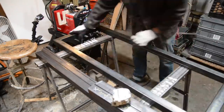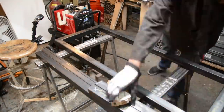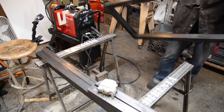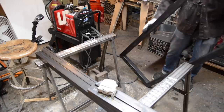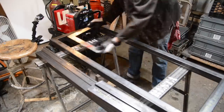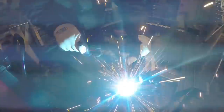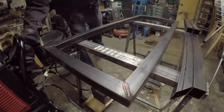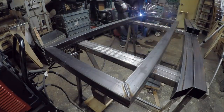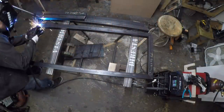This is what's going to be the seat — that's the spot where I began. I check my diagonals and I'm off by about three quarters of an inch, but because I'm just tacked I can still rack the frame a little bit by tapping it on the ground. Just those few little taps got me exactly where I needed to be. I checked my diagonal and also checked my 90 with a framing square, and now I start laying down some strong beads to trap that shape in space.